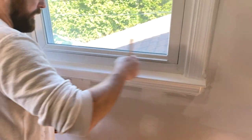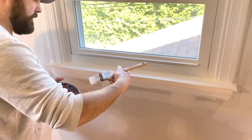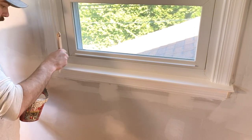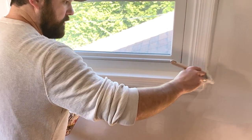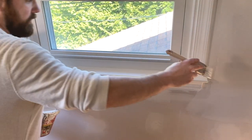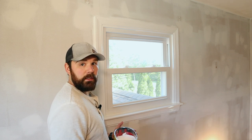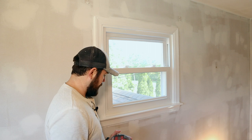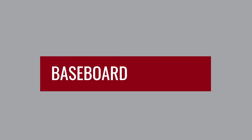I'm just working out the paint, making sure it's covering everything. We're going to do two coats on this. Sometimes you'll find little pinholes — you can just dab some paint in there and it will fill in a decent amount. Brush it out so it's nice and smooth. I really like this Duration semi-gloss because it's got a really good open time, so it gives you a lot of workability. That's one coat on all this — we'll do two coats on all the trim, but there's a nice window frame and sill done.